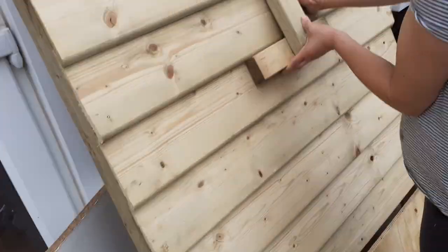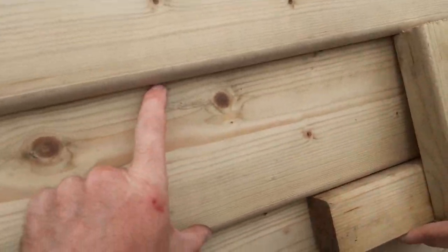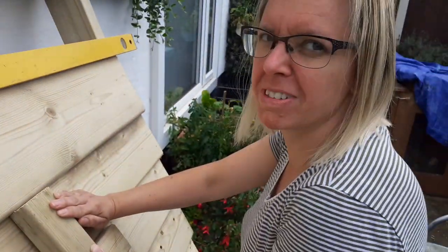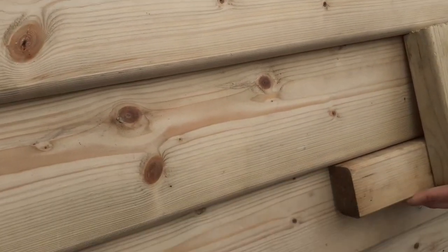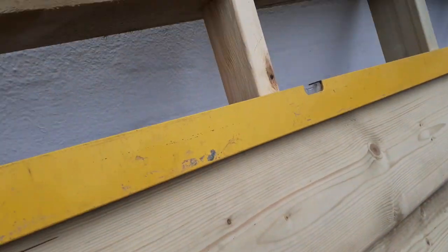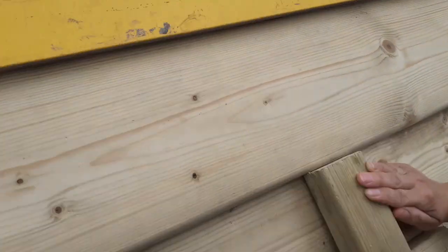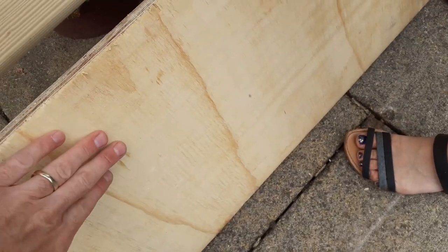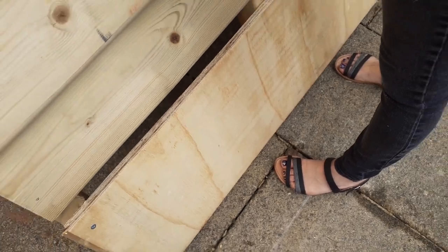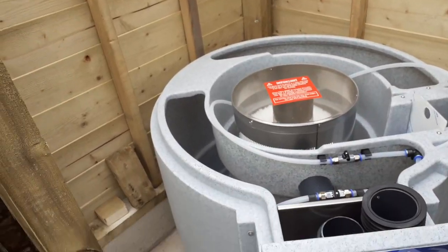Remember to get the camera out for this one. I've got a little system going — made ourselves a little tool to mark out how much space we need on each feather edge. Like I say, we're having to clad it before we get it on because of how tight it is up there. So we've nearly got the top of this one before we get to the slope, just making sure everything is 100% level. I go around, put the nails in, then we get the next one. The reason there's a gap here is because that's where the slab is on the side of the pond.